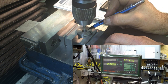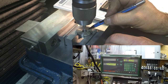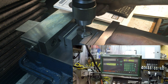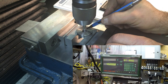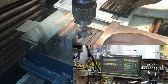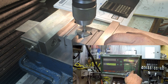Okay, since 0 is here, this is 45, and if I want to end back here, it's 360 degrees again, because those 4 holes are going to be divided through 360 degrees. But this is 0, so that's 360 plus 45. So that's what, 405, yeah, 405 degrees. So my starting angle is 45.